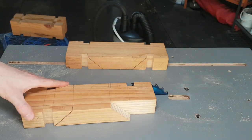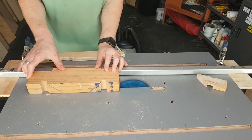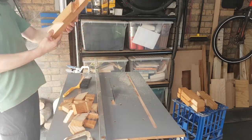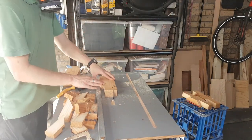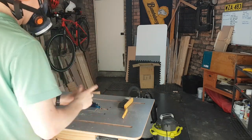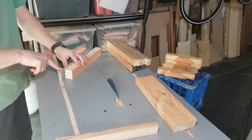The second cut here on the rip — my technique is really crappy but I will improve in the future — it did work. There's a bit of an overcut into the gap but I'm really not terribly worried about it. The important thing is I was able to figure out how to get these lovely 45-degree tenons cut using the saw right at the capacity of my depth. Some of these pieces didn't even come off — I just had to break off the last couple of millimeters to snap them clean. Quick clean up with a file and a chisel just to make the tenons slide better.